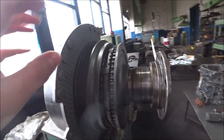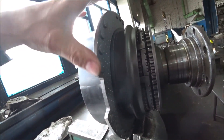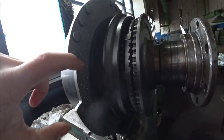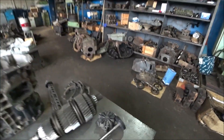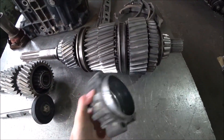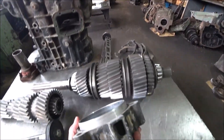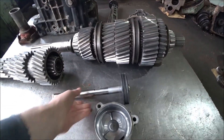Right now it's in the on position. This part with its protrusions is held in the box housing, so it's fixed in place and doesn't rotate — it becomes part of the housing. There are many protrusions here because the force is strong. A fork either turns it on or off via an air piston — a cylinder — and depending on whether air is supplied through this hole or the hole on the cover, it either engages or disengages.